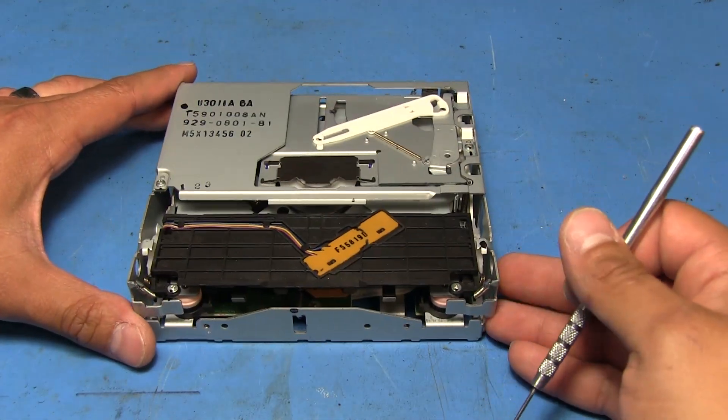Alright, I've got my new gear here and I've put it on the shaft partway — now I've got to push it down the rest of the way. These are just pressure fits. I usually push it in until the shaft is sticking out just a little bit on the end, then put it up against something — I'll just use this plier — and carefully press it in without bending the shaft or making it lopsided. It's partway there; just finishing pushing it in the rest of the way. We don't want it too tight against the bushing or it won't rotate freely.